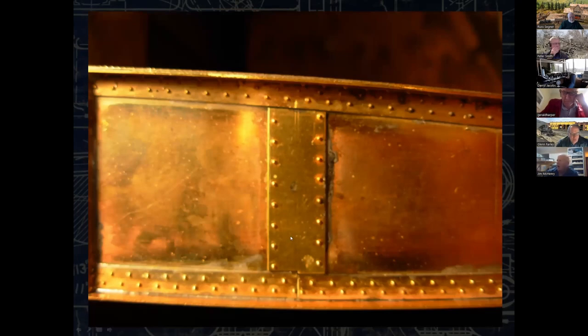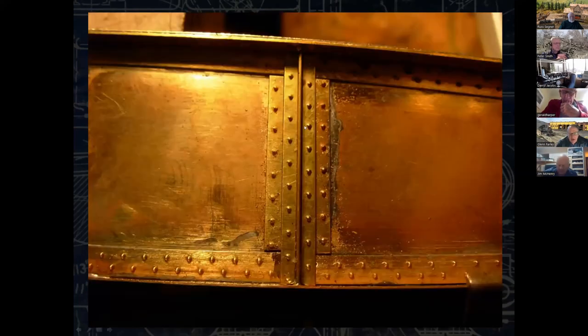This is a more major joint. There's a K&S L-shaped brass that's gone on here. We've applied the brass strips here. We've made wider brass strips here. This is kind of a double joint. I'm now building up another layer, which is here. And then there is a straight piece of flat brass bar, which I wish they were still manufacturing. That's going to go here, and everything is then soldered together.